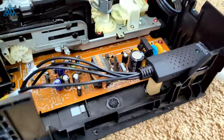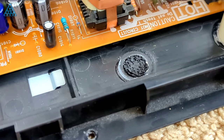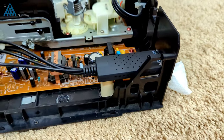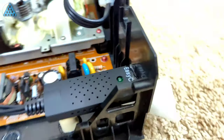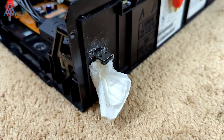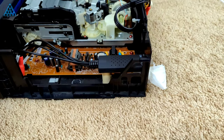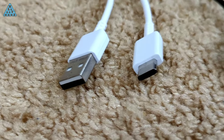So I'm in the middle of completing the redesigned data connections between the VCR and the display device. Where the tower was glued in place to hold up the EasyCap, I've removed it and moved it closer to the back of the VCR where it serves the same purpose, but now the EasyCap goes through the back of the VCR instead of plugging into the coupler. There's glue in different places drying right now and the revised setup should be ready tomorrow. Now that the connector behind the VCR is a USB-A male connector instead of the female that was on the coupler, I also need a new cable end to plug into the back of the VCR — the white cable was the old one and the black cable is the new one.